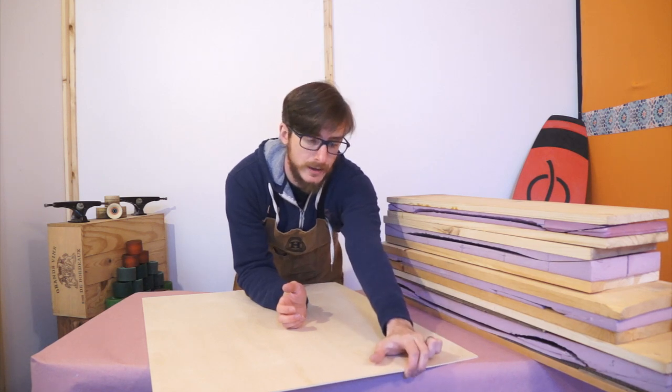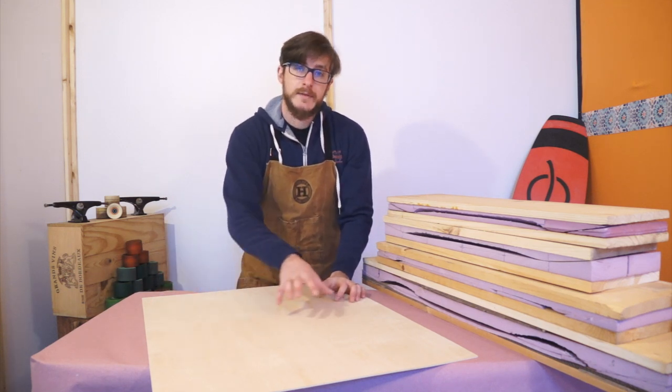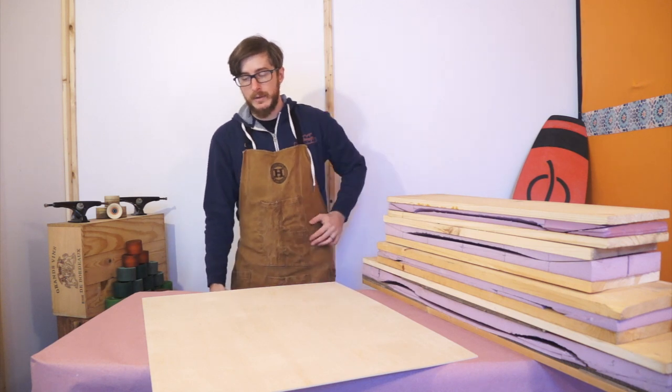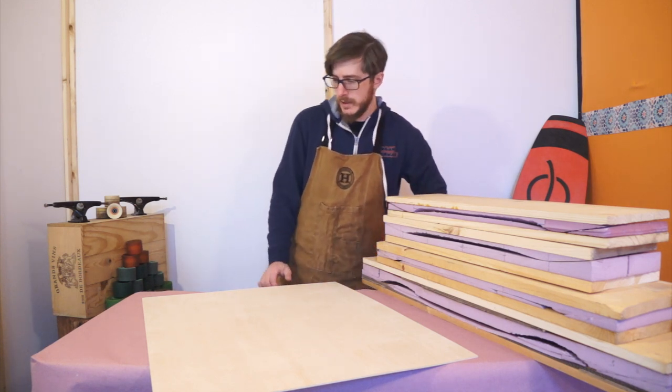This is an eighth inch sheet. It's got three veneers in it. What we're going to be doing is cutting this into thirds — three layers of plywood, which equates to nine plies. The way the math works out, we will have six long grain and three cross grain, so it should be nice and strong.